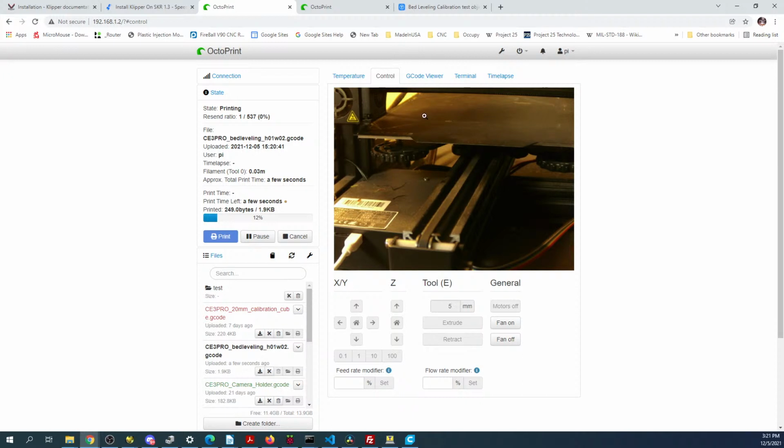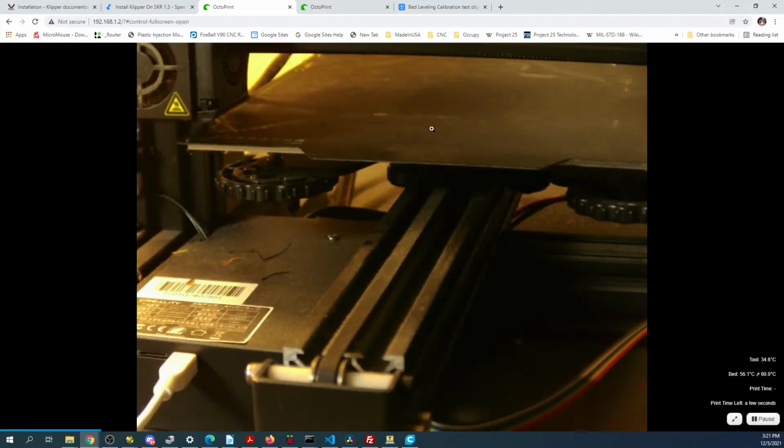Now it might print perfectly fine, I don't know. But we're going to have to give that a moment to see. The outer edge usually prints better. There might be a little bit of a bow inside of here. But if it doesn't work correctly, there's little arrows on these that'll say to move up and down. Usually I try and press it into the surface until I find the right consistency all the way around. So these are either up or down based on the rotation.